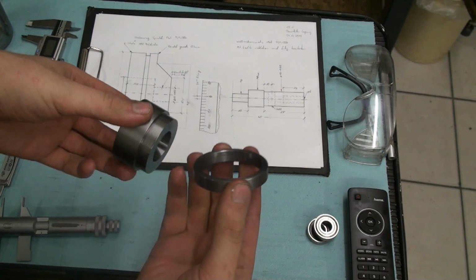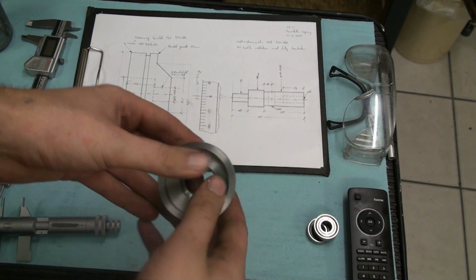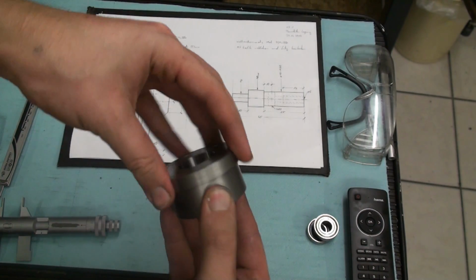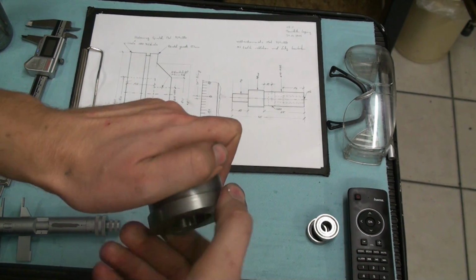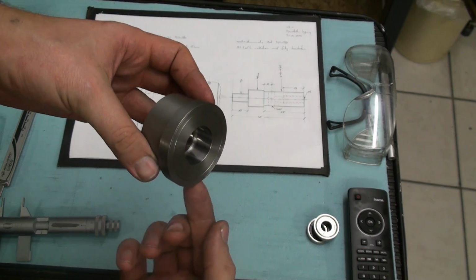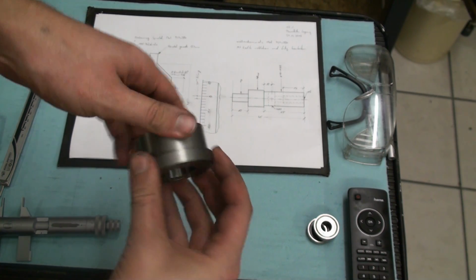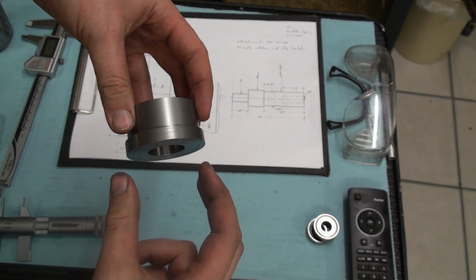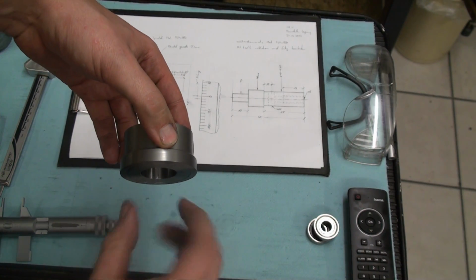Okay, this is the bearing block, and this is the vernier ring we will set on here, and this can spin freely. It's a pretty close fit, and it has some friction to it, and it really feels good, and I like it. And later in use there will be one locking screw, some screw with a small knurl, to lock it in place, and on top will be the vernier scale, and here will be the dial sitting, which will also be adjustable.